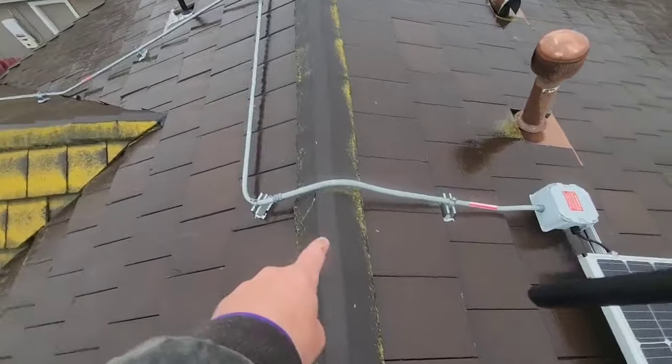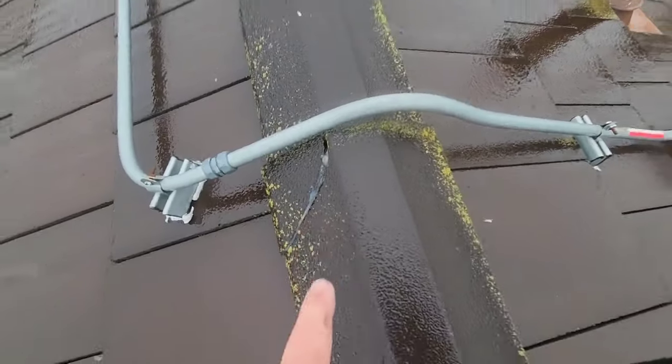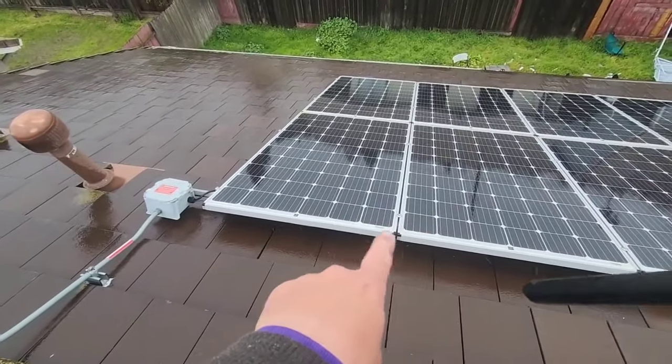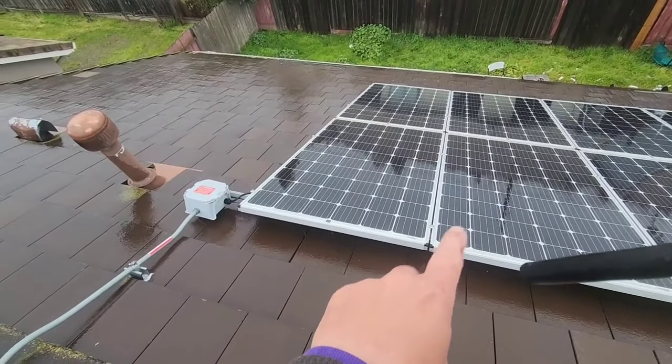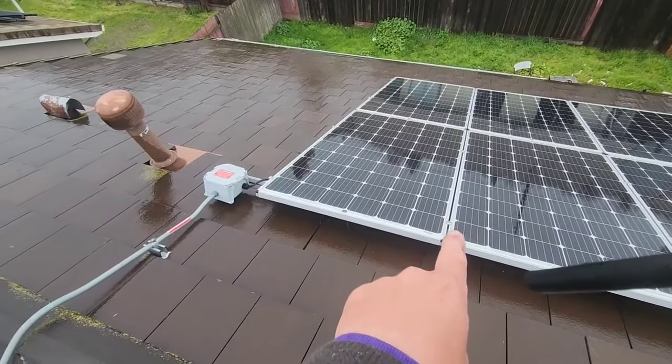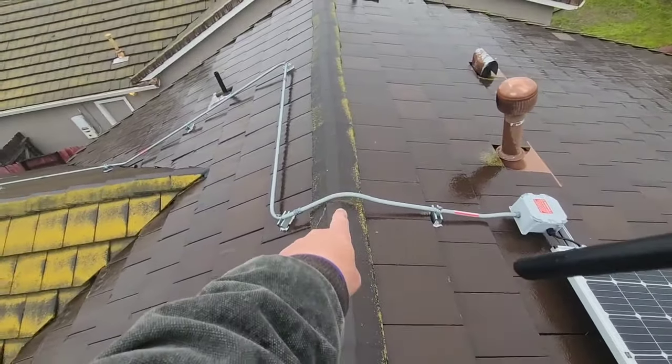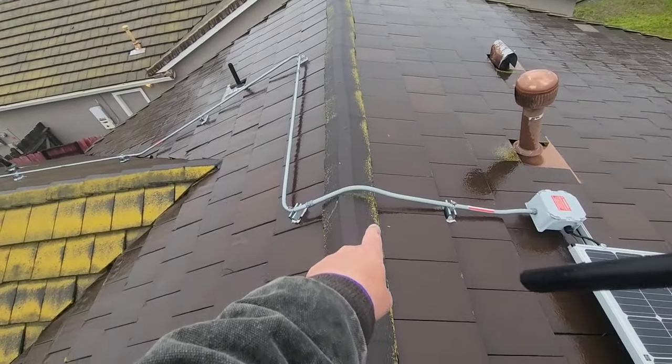If there's rot, the price will have to change a little bit and we'll replace the rot, then install new underlayment, new batten boards, and new tiles. As far as the middle bedroom, I would think there's a leak going on and I think it's coming from this broken ridge cap — and if not, then it's definitely coming from a bad bracket underneath here. It's hard to tell without being able to pull it up and open it up, but there is a broken ridge cap directly above that bedroom, so I'm suspecting that has a lot to do with what's going on.